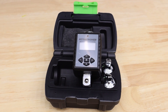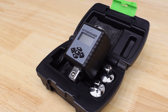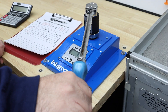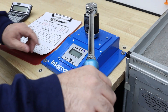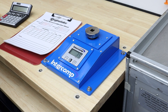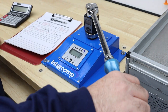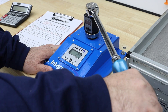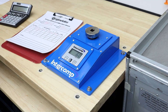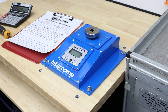Now we're moving from clicks to digital. This is the Pittsburgh Pro 68283 half-inch digital torque adapter. It fits between a half-inch drive ratchet or breaker bar and a half-inch drive socket. This thing was cheap, but it seems to punch way above its weight class as far as accuracy. I do have to say though, it's kind of a pain to use — it's hard to see while using it, and resetting it to zero takes a significant amount of time. But if you want digital accuracy and don't want to spend a lot of money, this might be the answer for you.